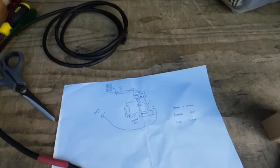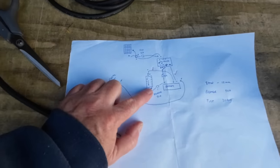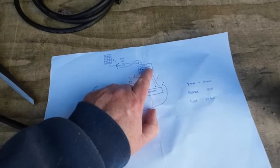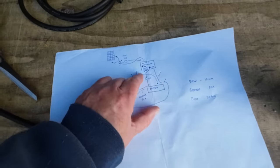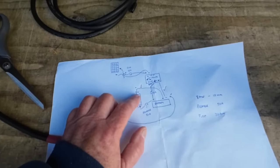I've got my simple diagram, I've drawn it a few times and made alterations, but I think I've got it pretty right. I've just installed the negative to the negative on the MPPT controller, and then I've cut the wire to run the negative from the battery to the fuse panel negative.